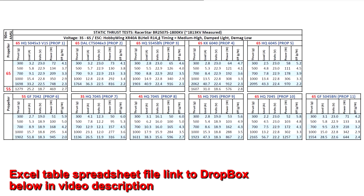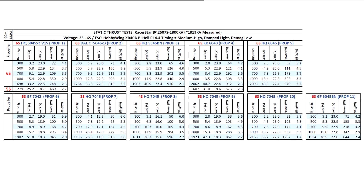Let's have a quick look at the thrust test results for this big motor from Racer Star — the BR2507S 1800 kV, measured right at 1813 kV, so very close to rated. Based on that kV, I tested on 3S, 4S, 5S, and 6S with various props.